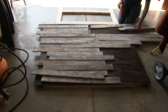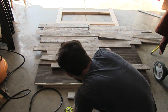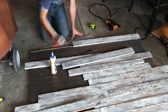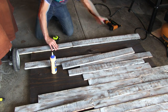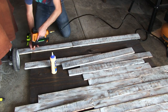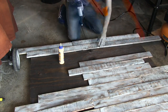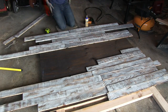Then the fun part began. We wanted the headboard to appear as though it was floating away from the wall. To achieve this, the pallet boards were going to extend a couple of inches beyond the top and sides of the plywood, which would totally hide the frame that sat against the wall. The total width of the headboard was going to be 60 inches, so I made sure the pallet boards had an overhang that would allow the full width to be around 61 inches. This was done so later I could come back with a circular saw to give each side a straight clean cut, bringing the width back down to 60 inches. It was very important to get these first top boards square so things didn't end up off and out of square the further we got down the headboard.